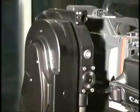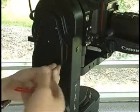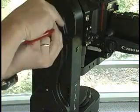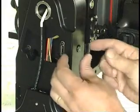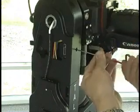To complete this job you will need a 3/32" and a 5/32" Allen driver. First, disconnect the power and communications cables from the Talon. Then, using your 3/32" Allen driver, remove the routing cover. With your fingernail, pry off the worm drive access button — this now gives you direct access to the worm drive shaft.